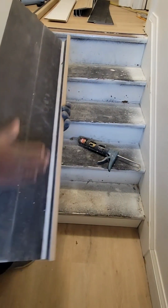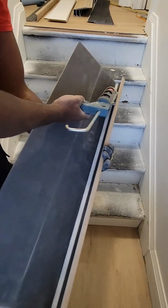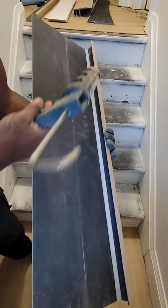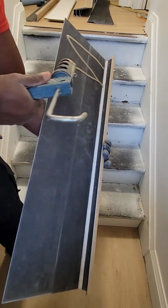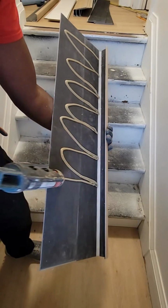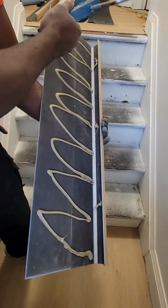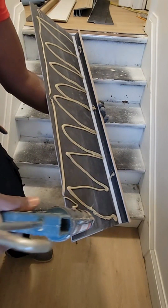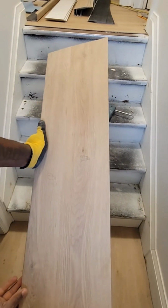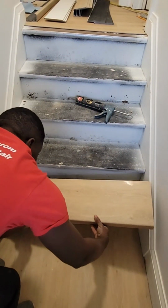A number of customers have asked us about simply making and installing the treads and nosings, and they would just paint the existing risers white. There's two main reasons why we don't do that. Number one, in any homes that we've been in where somebody has painted the risers white, within about 6 months, they're running into problems with it. No matter how glossy of a finish you get, you're just not going to be able to wipe down and clean a painted surface as often and as extensively.